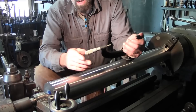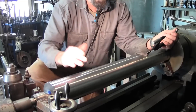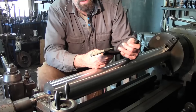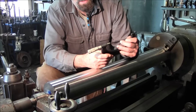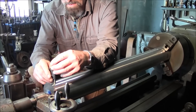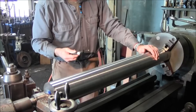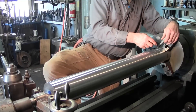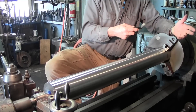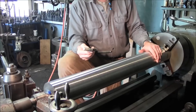There's a lot of reasons why your center is not going to be running true if you set it up here back there. So we got a four-to-five mic here and we got four inches - 400. It looks like we have about a tenth under that - four inches 399. So we're miking that up - let's just call that 399 - and we got 403 here, so we got about four thousandths difference. That's two thousandths that we're off-center on our tailstock.